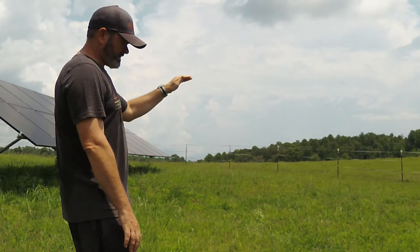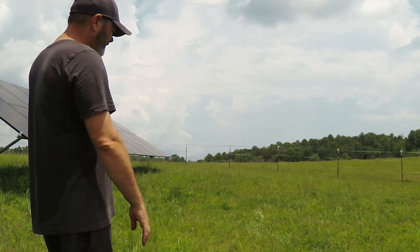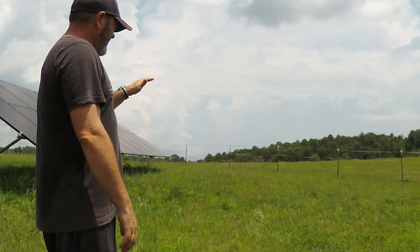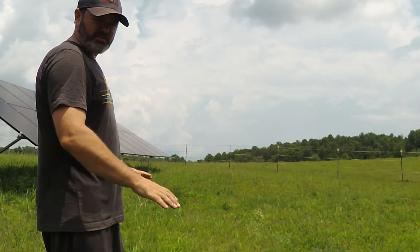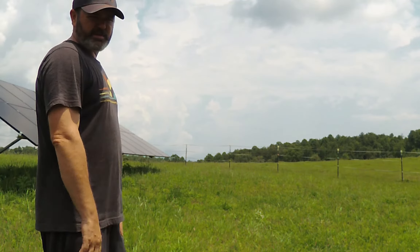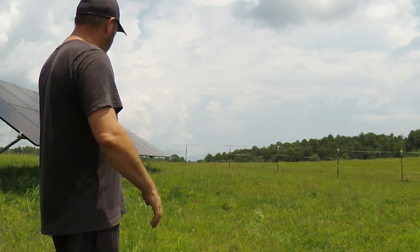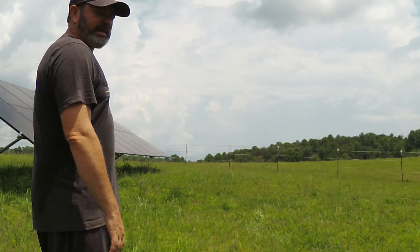The only drawback is I can't dig as deep downhill before I hit rock as I can uphill. But talking to Scott Hunt at Engineer 775 — he's who I got everything from — we talked about how we can do a concrete ballast in the ground over a wider area with a shallower embedment depth and still have the wind ballast that we need. So we're going to go just downhill here, perfectly lined up with this array.